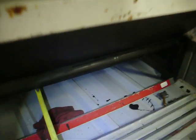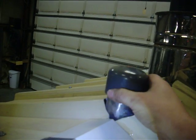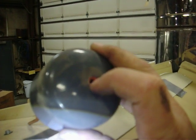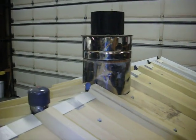I plan on putting 12 inches of insulation around this, and probably more on top. This two-inch piece of pipe goes into the water jacket, not the firebox. The roof isn't quite finished yet — I still need to seal all these up. This two-inch cap has a quarter-inch piece of copper with a little bend in it, about ten inches long. You drill a hole in this PVC, flare that copper out — it just sits in there so it won't fall through. It catches condensation and drips it back down inside. There's the stack — got it sealed up and insulated with ceramic insulation.